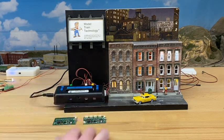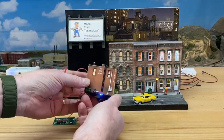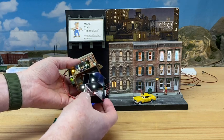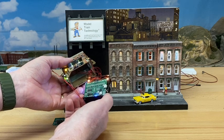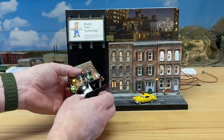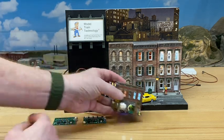The board parts are exposed, so be careful of static electricity — don't rub your fingers around them and don't rub your feet on the carpet. In our experience we've had very few problems with static. For the N-scale building, we made the canopy light and other lights using styrene and the same chip lights shown earlier. The board uses solder pads — it got a little tight in there, so I used tweezers to solder the pads, then just popped it in.